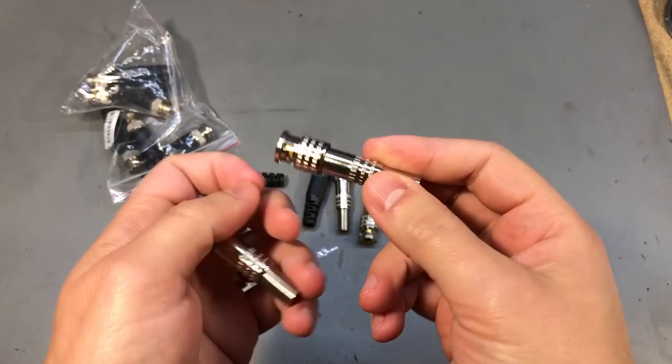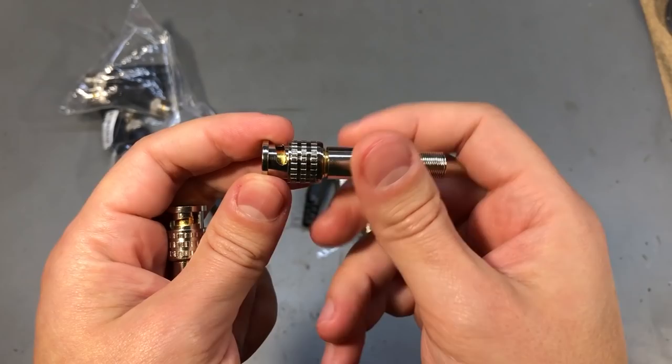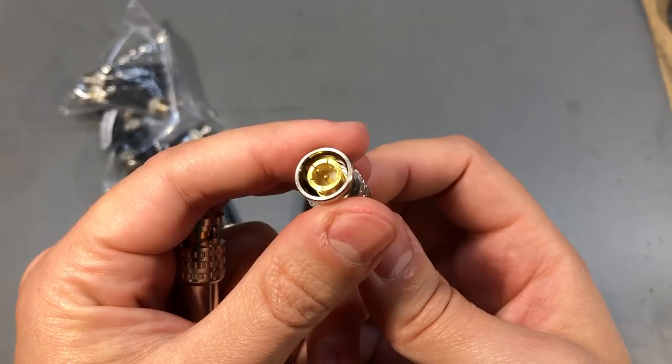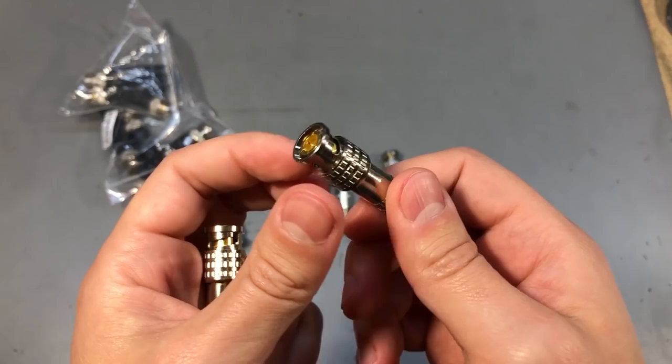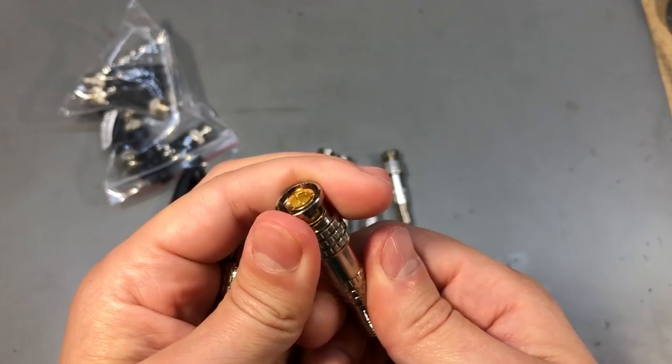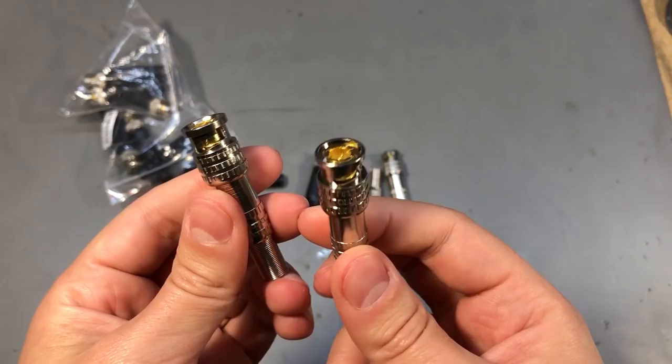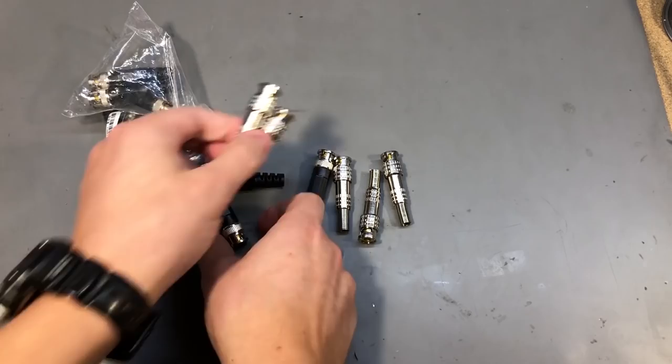While we are in the shielded connection aisle, let me show you some connectors I ordered. These are male BNC connectors which you can use to build your own coaxial test cables. These are not high quality connectors, so they're probably only good from DC up to low frequency measurements. They'll also probably wear out pretty quickly compared to a good name brand connector, but since I don't do much RF stuff, something like this won't be used very often in my lab.